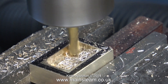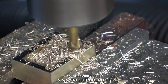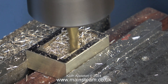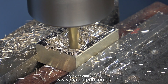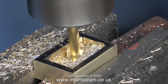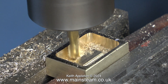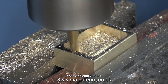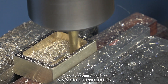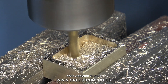There is a general trend developing here. I'm getting very close to the line now. I go around the edge and the job is generating a lot of swarf. I decided to use my vacuum cleaner to clear the swarf out of the way, but the old paintbrush I use is just as efficient. Now approaching the critical part as I get closer to the black lines. I'm actually not really following the black lines now, because I want the sides to be slimmer — with the exception of one part where I'm going to fit the handle. At this stage I don't have a black line to follow because I've cut into it.